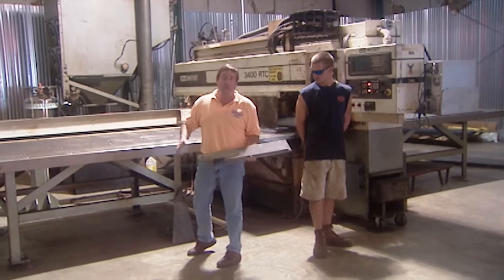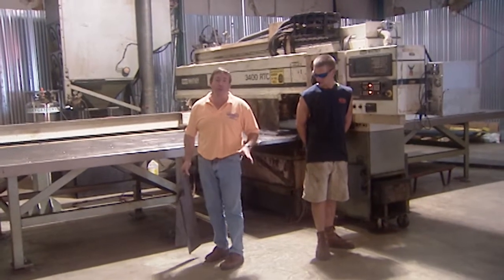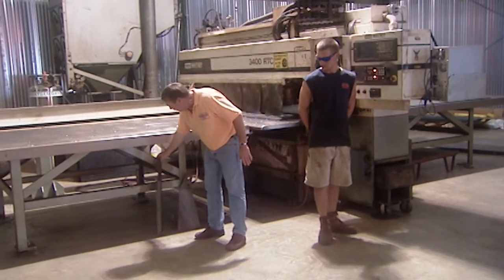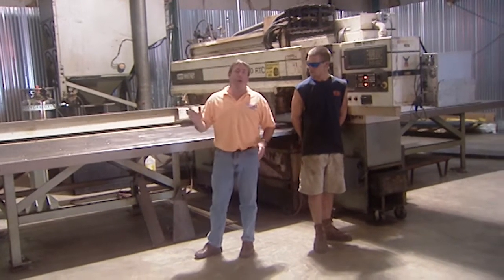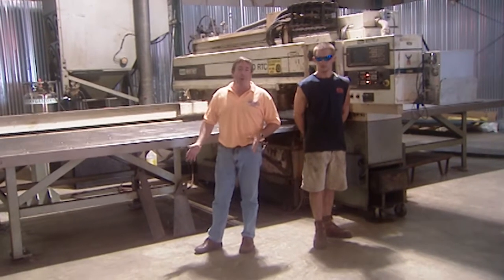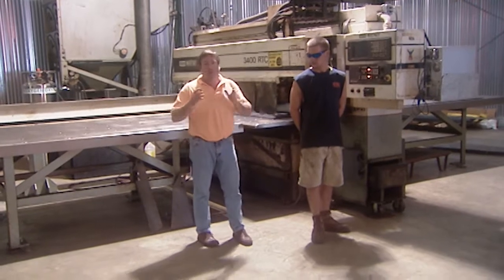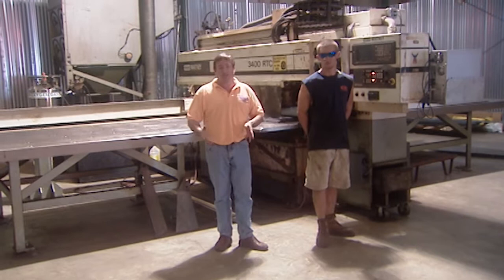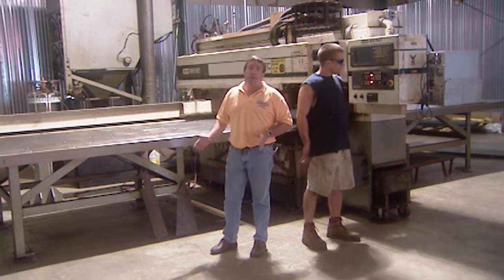I bought this machine used about a year ago. It was basically used for just the plasma part, cutting out bumpers for school buses. So all the punching part is still in really good condition. We just put new ball screws in it, X and Y rails, precision ground ball screws from Whitney. We just replaced the bearings in the head for the torch. It uses a Hypertherm 200 high-speed torch. This is pretty much the ultimate machine for this type of work.